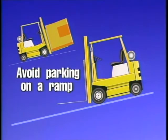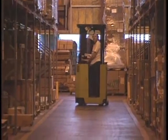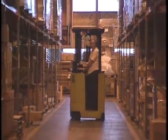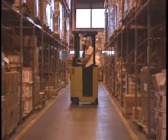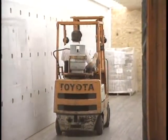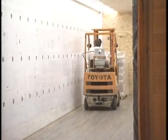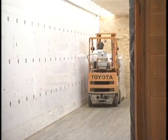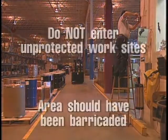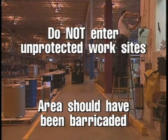Avoid parking on a ramp or incline. If you must temporarily stop on an incline, don't forget to chock the wheels. Complete scanning must be incorporated into your driving pattern so that it becomes second nature, even if you operate your truck in the same environment every day. Don't get complacent. The same environment can change, as trucks make their deliveries and freight cars arrive and depart, as other operators move skids and pallets of materials to new locations, or as workers working on ladders or scaffolding move from one location to another. Here, the maintenance worker did not protect the area. Being a professional, the operator must compensate for another person's mistake.